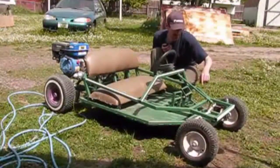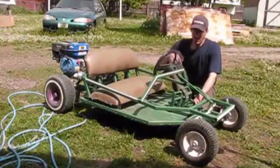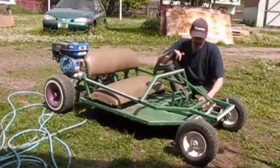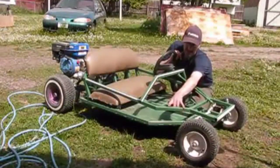Also, in one of my videos when I was building the frame, I had the plans right in front of me, and I can't believe I totally did this. But this bar and this bar I cut too long, 3/4 of an inch too long. It's supposed to be at 3/8, and I cut it at 5/8 or 7/8 or something like that. Once I realized how much I cut them wrong, I propagated that same screw-up up to these two.